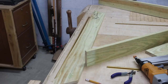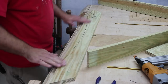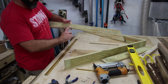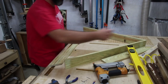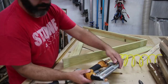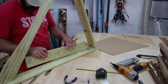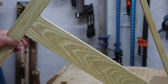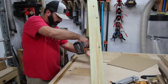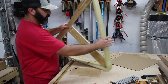I've got a few finished nails and a wooden yardstick to make my curve, and I'm cutting it at the bandsaw. I just want to give some visual interest to the overall structure — this is going to be the only piece that's curved. I tack this back into place, and then the piece I cut just before — I can now install that one. I drilled a couple of pocket holes on the back side so you can't see them from the ground when looking up. I installed it with pocket hole screws and now I'm just tapping this back into the center where it should go.